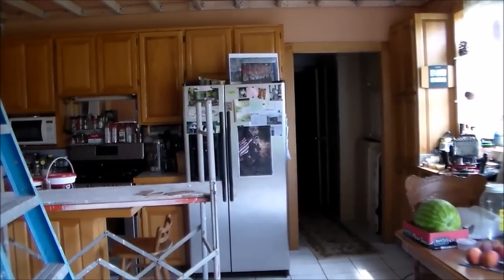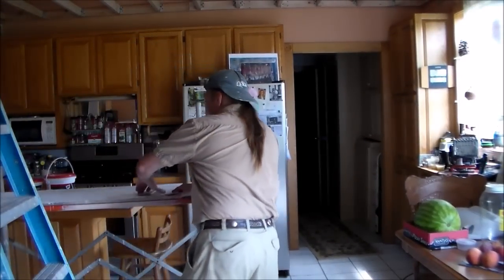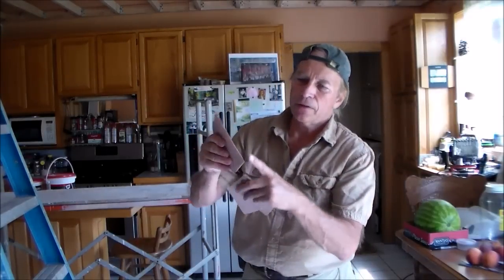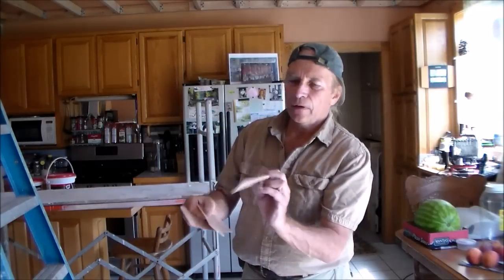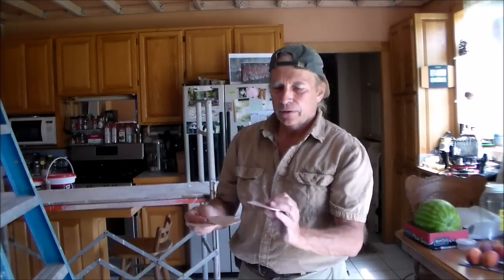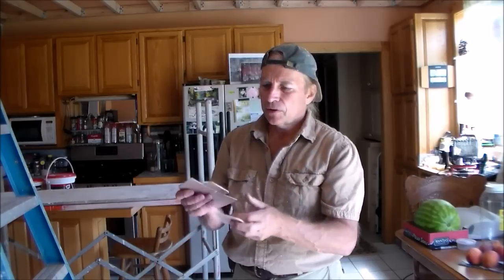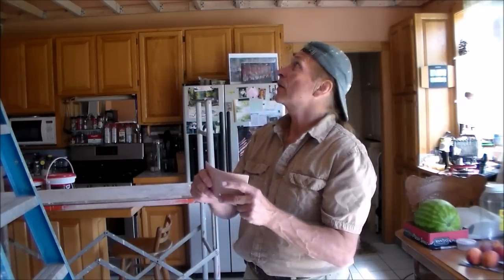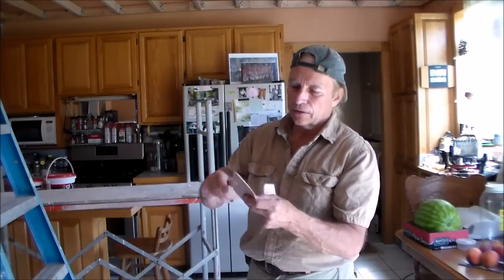And what I use on the inside of the dome, these are auto body plastic spatulas. They have rounded corners and they flex. So you use the smaller one first, and it'll conform to inside the sphere. The hard, rigid metal spatulas or trowels for drywall just are not going to cut it. They have sharp corners that'll cause scraping and gouging as you're forming inside that dome.